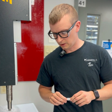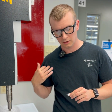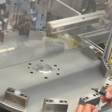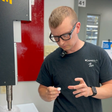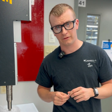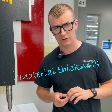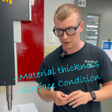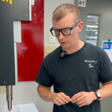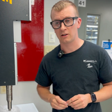These are both a nice design and they're also well suited for us. We design and manufacture both our own tooling and our own plastic parts here at Aerologic, so we can control a lot of the aspects of the umbrella check valve design — including how thick the center section is, the surface condition, and how much we let the overall movement happen. We've been having a lot of success with those on low cracking pressures and also dialing in an exact cracking pressure.